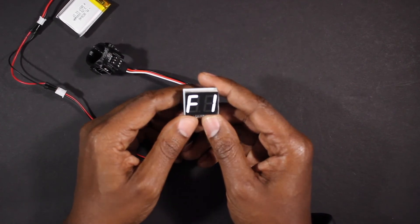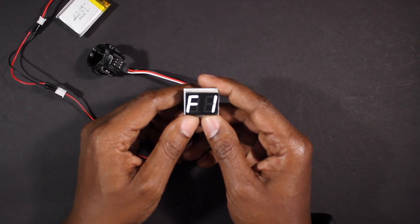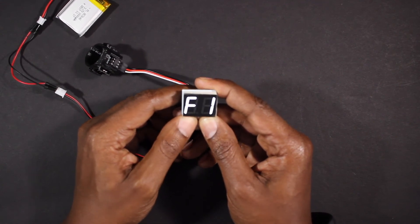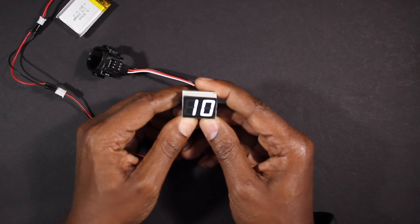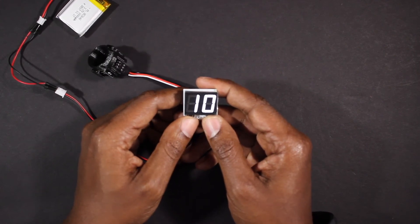The last feature is the fire mode. The default is F1 for kits that use an IR beam; F0 should be selected for fire switch mode if you are planning to use a switch to count down. Once you've changed the setting, press and hold the left button to save and exit. Remember that you can always factory reset if you have trouble with these settings.